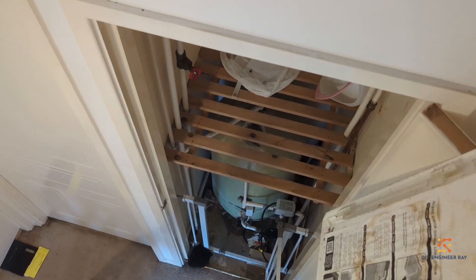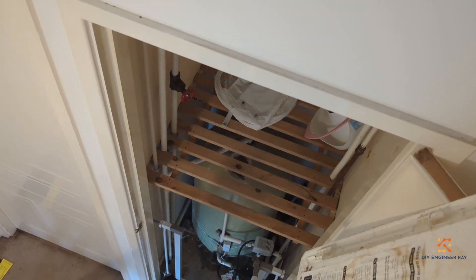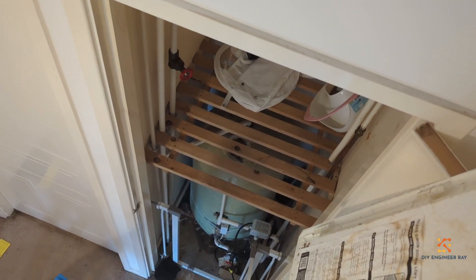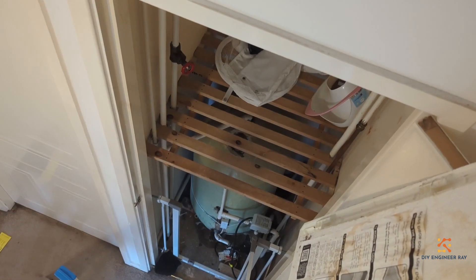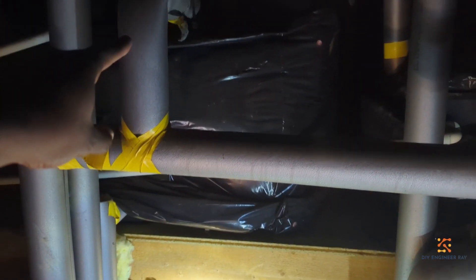One of them is a valve. The pipe to the extreme left-hand side carries mains water — that's cold mains water from your city council. That water is going to come up through this pipe, and then it will bifurcate into two. That's going to be your inlet to the larger tank, which I'm pointing at now, and then also an inlet to the smaller tank. So that's your inlet to the two open vented tanks.